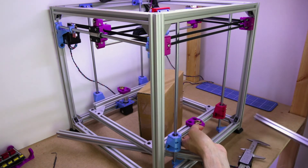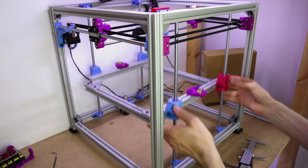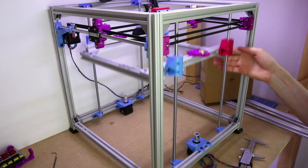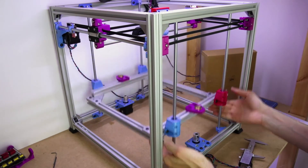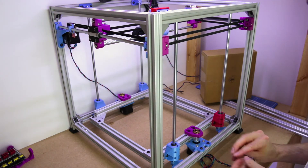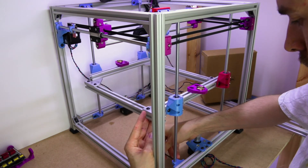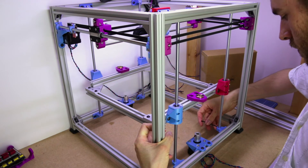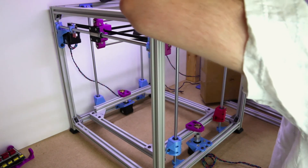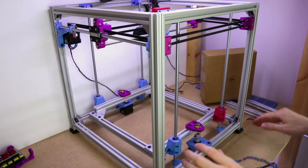So now we can pull these out — look how much better that is. It barely wobbles at all, though there's some wobble on the other side still. So now we've done one side. Before we go to the other side, we're going to tighten these little clamps — tighten down those M3 screws so that the shafts don't move, because we don't want them falling out. They probably wouldn't anyway since the clamp is tight enough to hold them. Now those shafts are not going anywhere — happy days! Getting on nicely. So now we'll switch around and carry on with the other side.